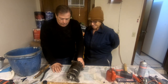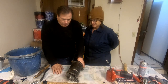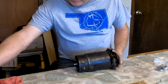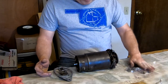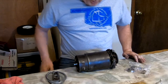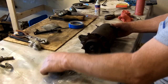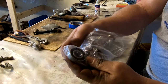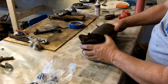I think we ought to order new brushes, and I wish I had a better way to test voltage on this. The replacement parts came in for the generator, so I'm going to go ahead and work on that now — get this thing painted and put back together. I got the end cap off and I'm about to separate it. We need to replace a bushing, a bearing, and a couple of brushes, and then we'll obviously need to paint the outside.